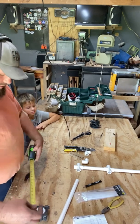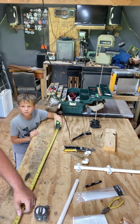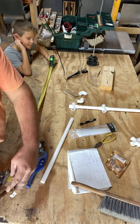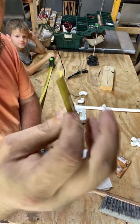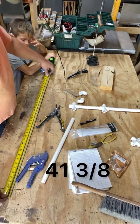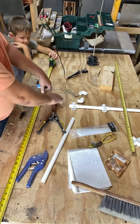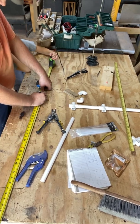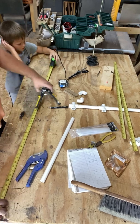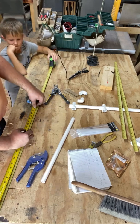Now we're going to cut our tape measure. We're going to cut this off at two inches. This piece is going to be 41 and three quarters — that's going to be the reflector. We're going to cut a director element at 35 and an eighth. Now we're going to have two pieces at 17 and three quarters of an inch.